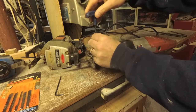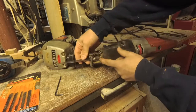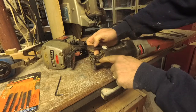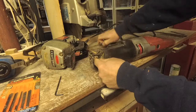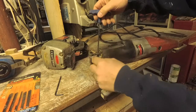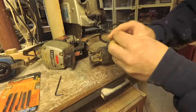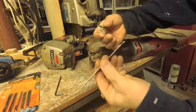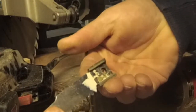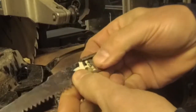So you're just going to loosen that up a little bit. You can see this is all afloat now. The screw can stay in, because what catches the blade is there's a hole right there in the blade and a little dimple in this plate in front of that screw. I can actually take that right out and show you so you know exactly what I'm talking about — sometimes if you can see exactly what I'm talking about, it makes more sense. So there's the screw right there. Here's the plate. See, there's that little dimple right there, that little pin that sticks out. And when you slide the blade in there, it's catching on that pin. Then the screw is right behind it and tightens it all down so it can't come out. That's what's happening inside there — it squeezes it down tight and you're good to go.